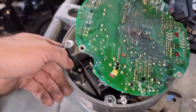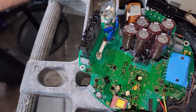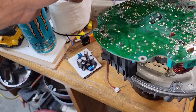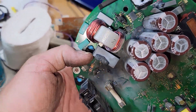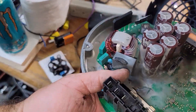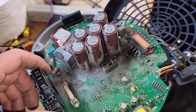So this is another 230 volt one — one of those ones where I again forgot to reach down and loosen this spring-loaded deal to let loose the IGBT and rectifier. So I pulled it out, and I'm like the MOVs are not all exploded like they were on this one. Now remember, this is the one I worked on the other day — I pulled it apart and it looked really bad in here. I busted out all the MOVs and kind of just laid it together, turned it on and it actually worked. But then I had torn the insulator for that and it shorted when I put it back together.